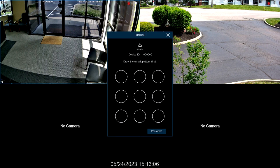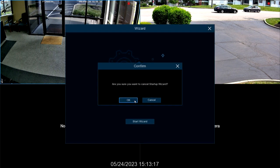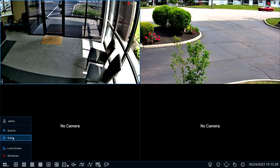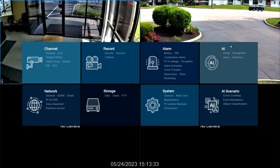If you're not in front of your NVR/XVR currently with a camera that supports LPD, go ahead and get in front of it and log in. Once we're logged in, we're going to go to the main menu — go down to the bottom left corner, select the extension menu, and go to Setup. Within Setup, we're going to go to the AI section and select Setup.